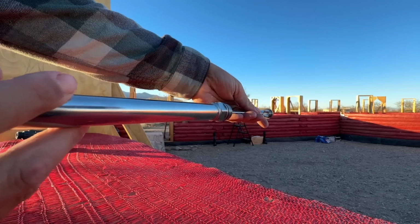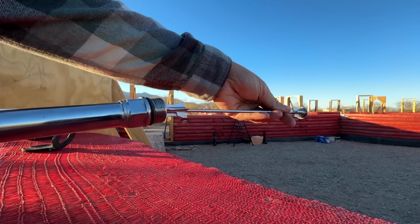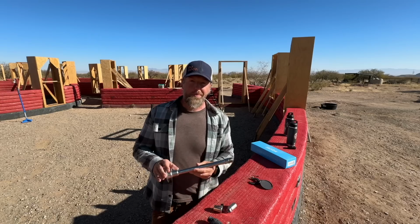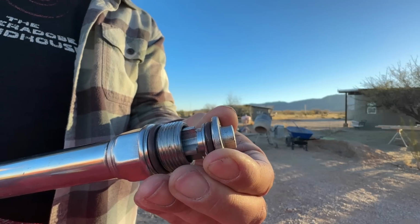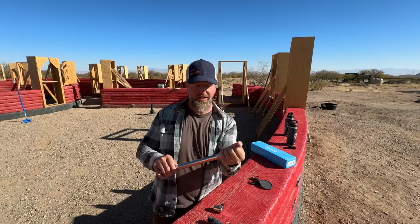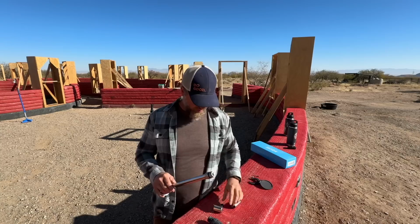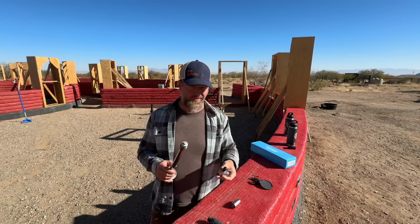Like we said, this is, I think, the only frost-proof water spigot made out of stainless steel. Therefore, it's going to be a lot more durable, more insulated. The mechanism on the back that seals it is actually held closed by a spring in the end piece that screws on. So there's a little spring and that pushes on here when you screw it on. You can either just do threaded, or we have a 90 PEX. You can get a straight PEX. I'm not sure what we're going to do yet. We just got a few to test it out.